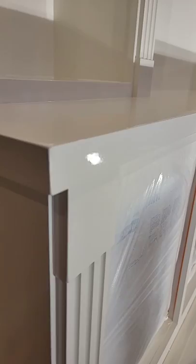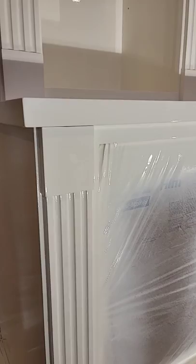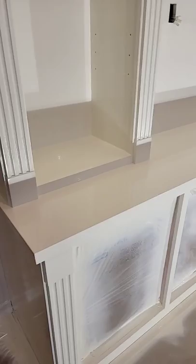The nice thing about being able to put a heavy coat on like this and not have any runs — even when it's sprayed vertical like this — is it gives it time to level out. You've got to put a lot of coating on. This is probably in the five and a half, maybe four to five wet mils. It's pretty thick, but this is what gives you that butter finish.